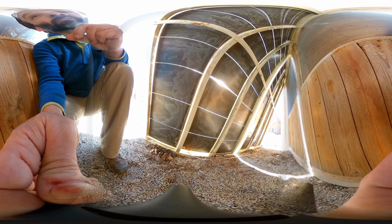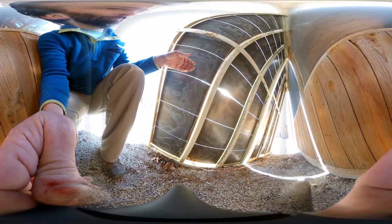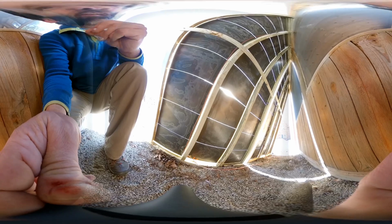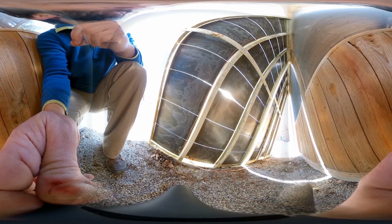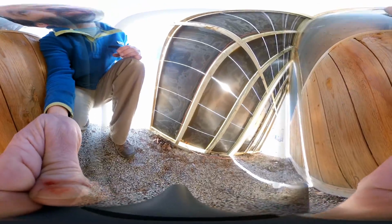There's 60 panels here right now. In the morning they're generating 125 volts together. I used some leftover fiberglass screen just as a backer. About a gallon of Bondo per 4x8 panel is more than enough. You kind of learn as you go. I think I put way too much on, but you can see all the air gaps. These are important. If these touch, you can have a short. So that's the panel.